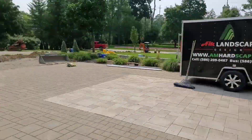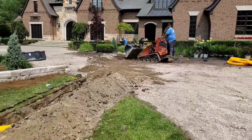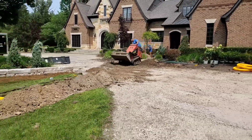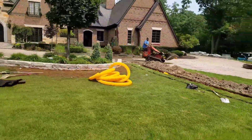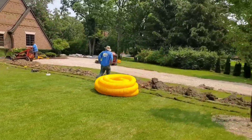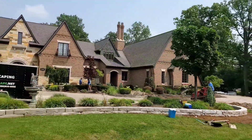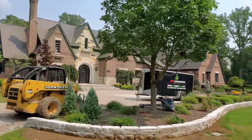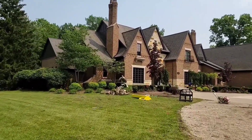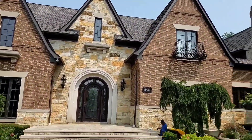I've got to give a shoutout to AM Landscaping for getting us on this job. They're going to brick pave this massive driveway — they did this beautiful patio and they told their customer about us. This is Bloomfield Hills, Michigan — a beautiful estate home. You can see just how big that six-inch coil was when Valente was rolling it across the grass. Look at the roof on this house and all the roof runoff we're catching. When you're catching a lot of roof runoff, even if you just have two or three downspouts, you want to go to a six-inch if it's a really big house.